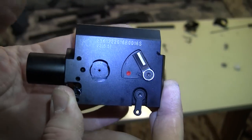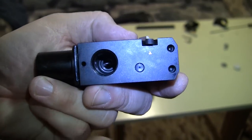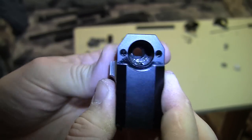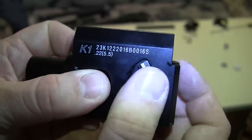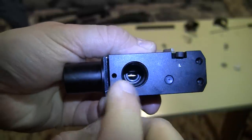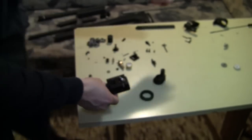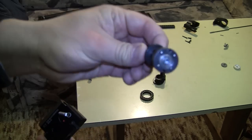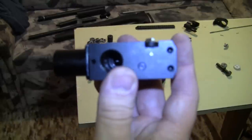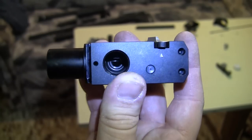For operation it requires two valves. One is set vertically — I'll show it — and the second one is placed horizontally. The horizontal one is the main valve that opens when you fire the gun, and the vertical one closes it. The vertical valve is connected through a rod to your power knob — so with the knob you dial in the power.